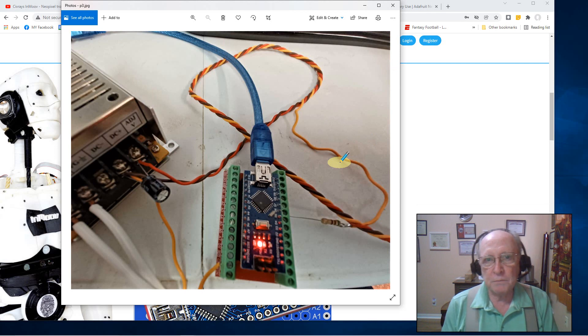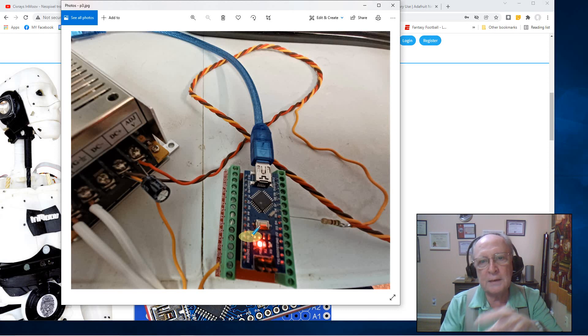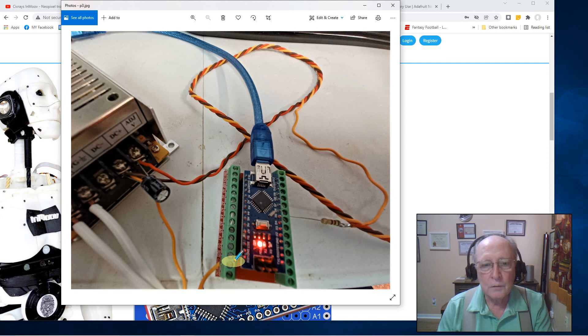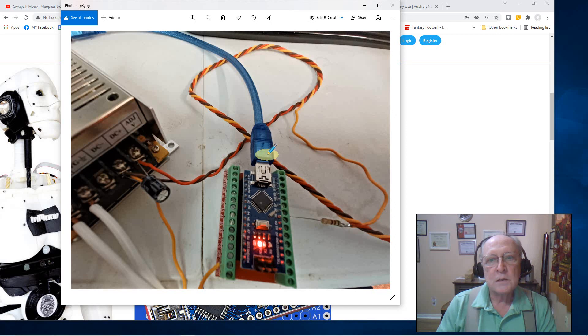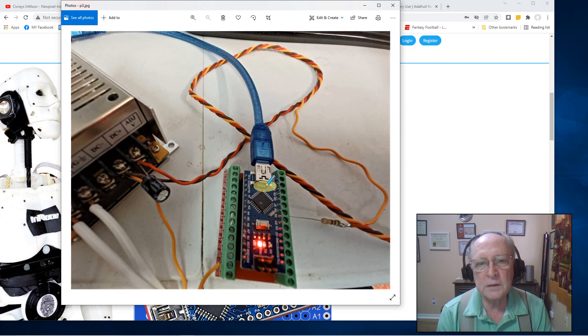Here's my nano chip. Back when I was doing model railroading, I ordered these nano breakout boards off the internet and they proved to be priceless. They give you a nice socket — you plug your nano chip in, and if you ever need to replace it, pull it out and put the next one in without disturbing your wiring. The wiring is done through screw terminal strips, so it's solderless and much easier to work with. Here you can see my USB cable coming in — that's how I'm powering the nano and controlling it through MyRobotLab via the USB port and its RX-TX capabilities.